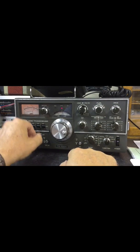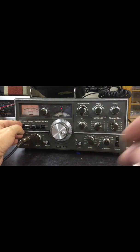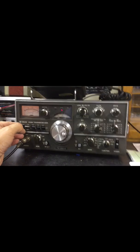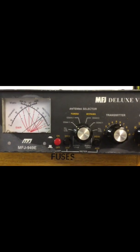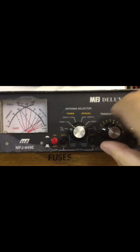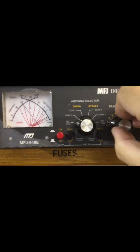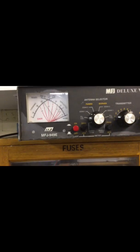That is pretty much it. We go to RF. We're on CW. This meter is a little bit off. Now what we're going to do is go back, transmit, and actually listen first. I can't hear anyone there. So we're transmitting about 130 watts, and we're just going to peak this to get it as near to one-to-one as possible. We're running about 110 watts and everything's nice and low SWR-wise — to the radio, that is. So let's stop transmitting a tone.